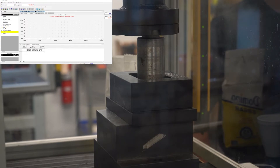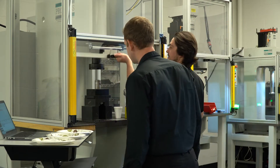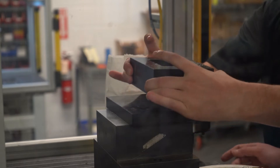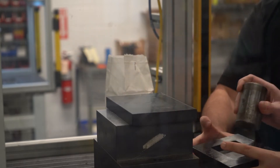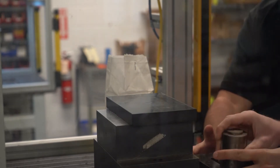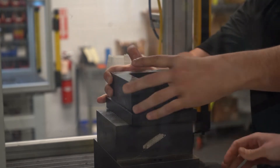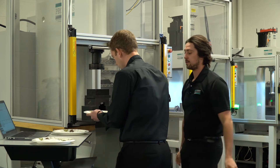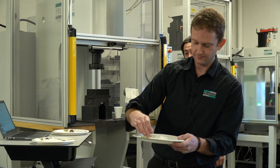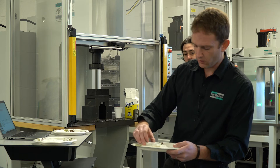It's going to dwell for three seconds — that's what it's doing down there — and then it's going to return back. All right, let's check the results of that. I'll use this second plate for 80 kilonewtons. A little bit better. Here you can see this one is much more compacted compared to the 40 kilonewtons — still not enough, though. So let's add more force.